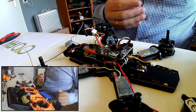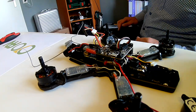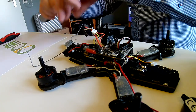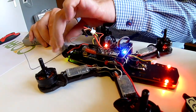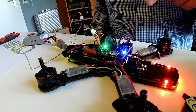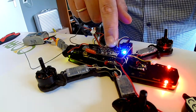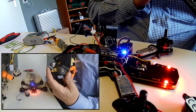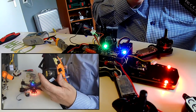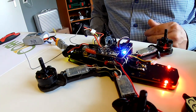And then if you either have a low battery signal or you program a beeper, you actually get some nice noise. I'll just demonstrate it for you. So in this case, during init it already gives you a nice beep. The 3 beeps you hear now — those are from the flight controller. Typically if you arm, like this, you hear some beeps. And then also if you program a switch for buzzer, like I have in this case, you can make it do beeping. While it sounds nice here, it is not so loud when you're in the field.